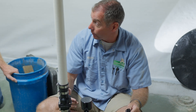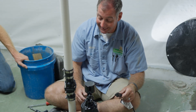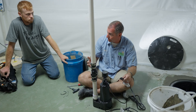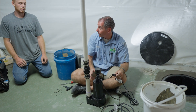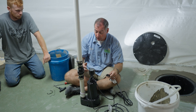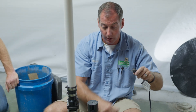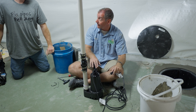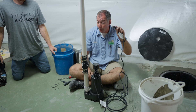Not all sump pumps have two cords — some have an internal float switch with just one cord. One perk to the piggyback float switch is that if the float switch goes bad, you can replace just the float switch without replacing the pump. That said, it's a bit of a false sense of security — if your pump is old enough for the float switch to go bad, you probably want to replace the pump too. What we do is unplug both cords, throw away the piggyback switch, and plug the pump straight into the receptacle to test if the pump itself still works.